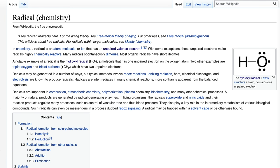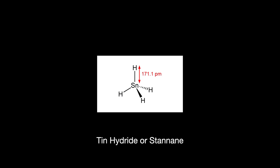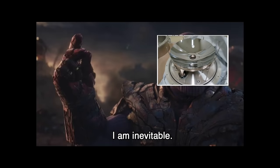Thus, these hydrogen radicals will react with the tin, floating away from the mirror in the form of a gas called tin hydride. This cleaning does not stop the collector's deterioration, merely delays it. It is inevitable. But it did help Zeiss get substantially closer to its one replacement a year goal and overcome one of EUV's major obstacles.